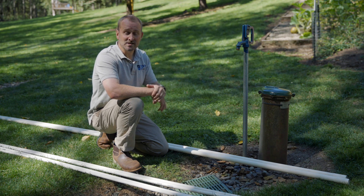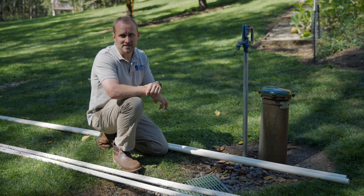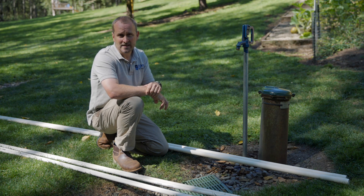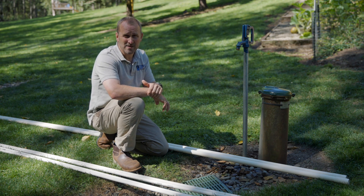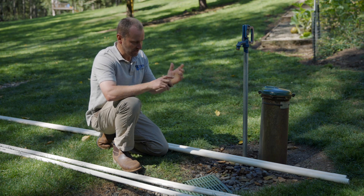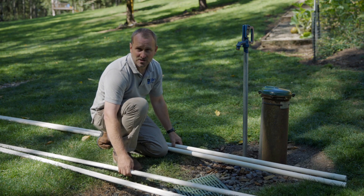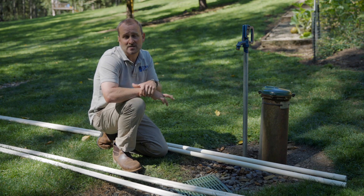You're going to need enough pipe to go 10 to 20 feet below your static water level. If you have a well casing smaller than 6 inch you're going to want even more room for additional drawdown. The well we're installing today has a well report that states the static water level is at four feet down. That was done during winter and we're here in September, late summer, so we're assuming probably 10 to 15 feet down. We've got enough pipe here to do 20 feet and then some extra just in case the static water level is actually deeper than we thought.